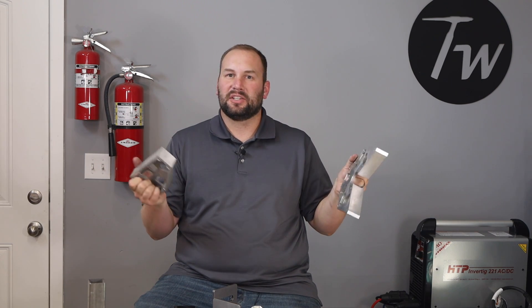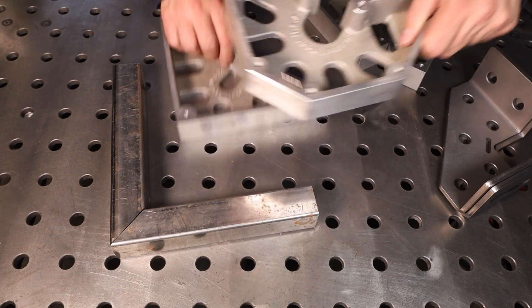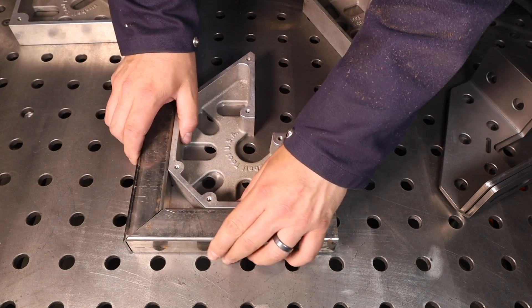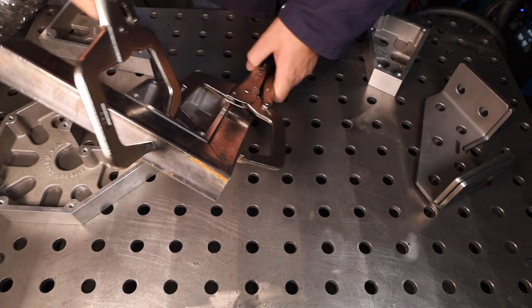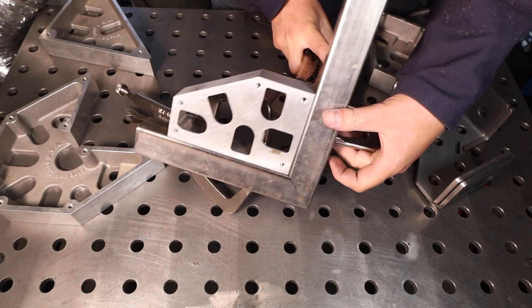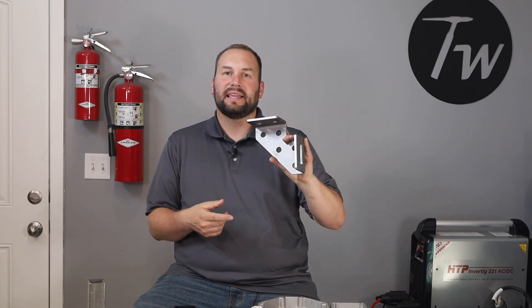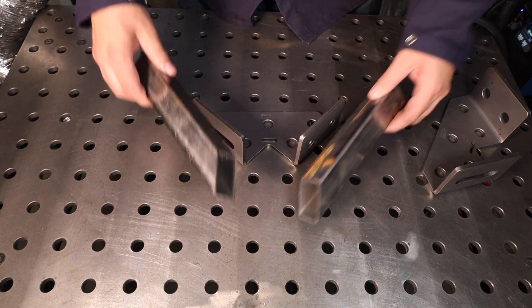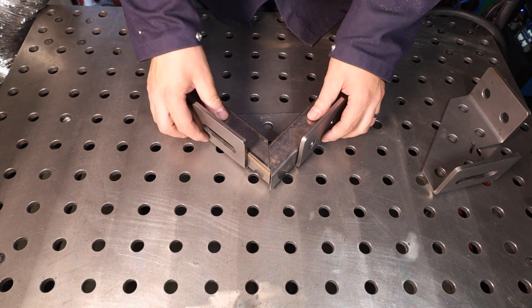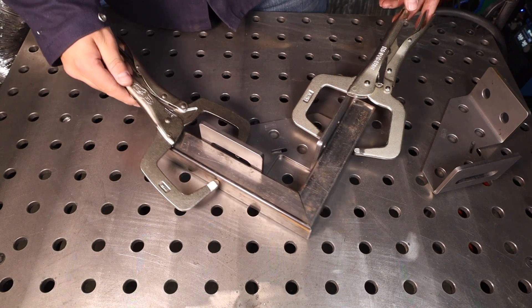These ones are cast welding squares made by Fireball Tool — I'm not sponsored by either of these companies but I do think they make a good product. These cast Fireball squares are really handy. You can put them in place and they come in a bunch of different shapes and clamp your material right to them to hold everything square while you get it tacked up and fabricated. Another kind are these from Genuine Metalworks, and I like these really well because not only can you tack with them, they have enough clearance so you can weld things out. You can clamp things in place and hold everything true and square.